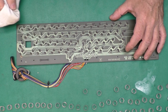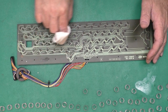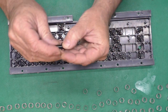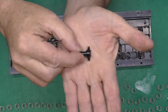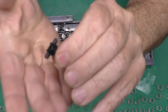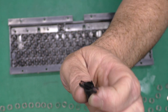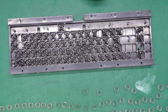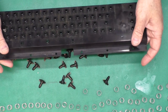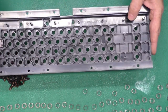Here we have the rest of our keyboard assembly with all these plungers. They're kind of T-shaped plastic pieces with a silicone rubber springy piece across them. The black piece right here is actually conductive rubber — that's silicone rubber mixed with carbon black. We need to dump all of these out so we can clean up this shell. Got them all in the sink.